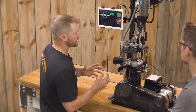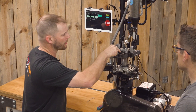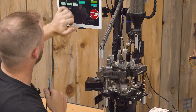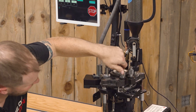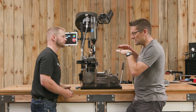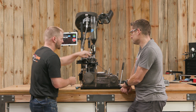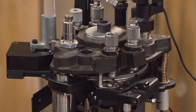When we're setting our primer seating depth in our station, we're focused on the die and the primer seating depth pin. This takes a 3/16 Allen. Be careful when making any adjustments to this pin because a little does go a long way. First, let's set our sizing die. Move to bottom and run our sizing die down until it touches the shell plate — you can see it touching the spring, making the spring move. That establishes where the tool head is going to come down and rest. If you're hand operated, you run the handle down until you feel it make contact with the internal stop. We make contact with the shell plate, then back it off one quarter turn to give enough clearance — that ends up being about 5 thou. Then lock that die in place.